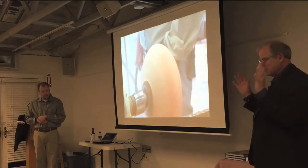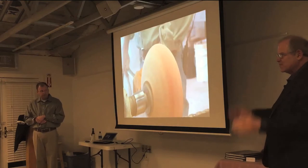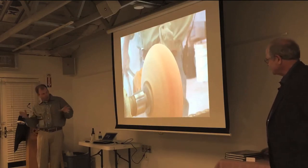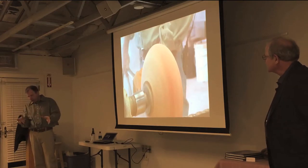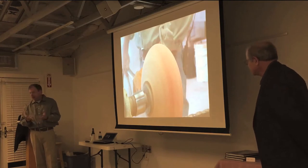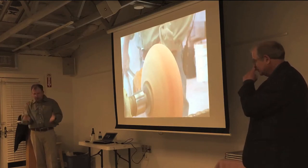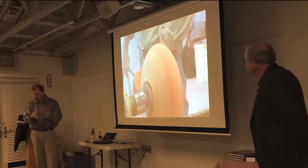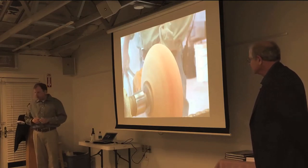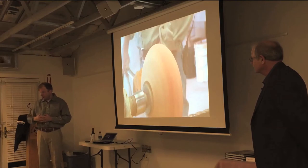They're just the proportions. I'd love to hear your narrative about what's going on here. So after we final shape with the tools, freehand, where we cut the outside and thin the walls down on the inside to their final thickness, we hand sand it. A rotational disc sander levels it out, and then we hand sand from that point. At the next stage, we go on to coating the piece, which has layers of coat or finishes.